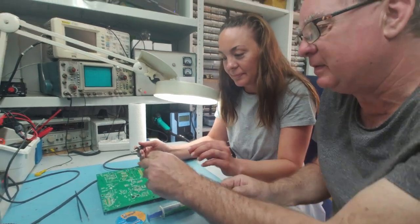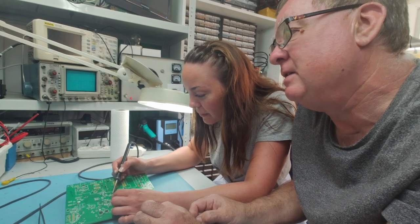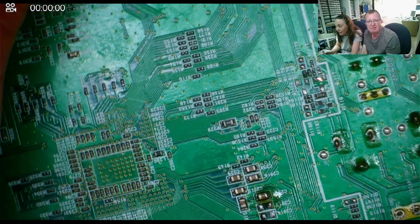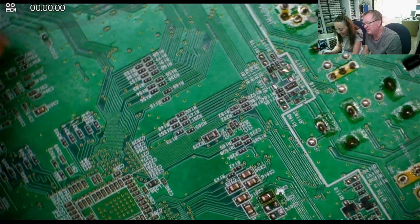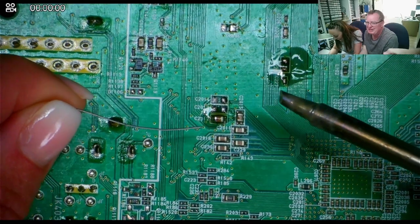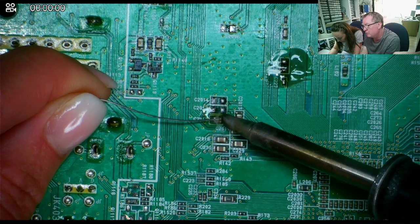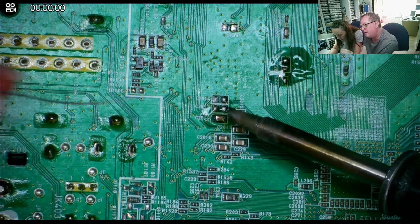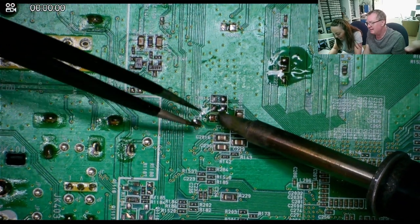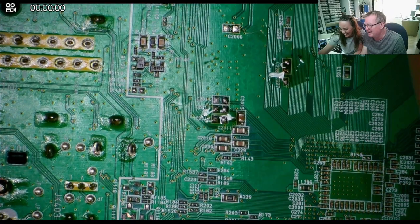And then you need to get some of this solder wire. Push the solder iron flat against one end and feed some wire in — feed a bit more wire. A little bit more wire. You've got it. Can you see that's shiny now? Sarah has better eyes than me, by the way guys — she's doing this without any magnification. So turn it around. Back on again with the flat of the solder iron and feed some wire in. A bit more. You've done it — it's off. Get your tweezers. There you go. Was that easy? Yeah, it is. That's what I say, guys.